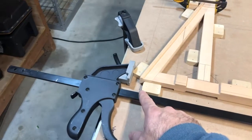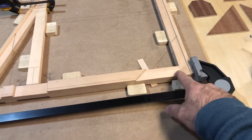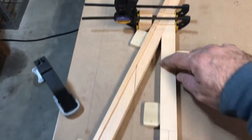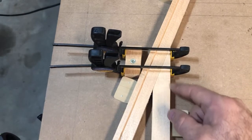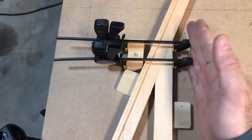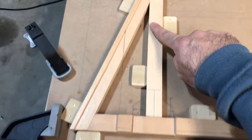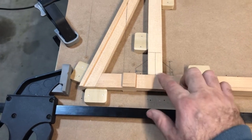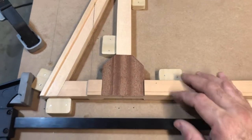This clamp here runs across and is held against this block, so as this piece pushes on that one it puts pressure on this joint and this joint. For this piece here, all I did was put a block there so I had something to clamp to in line with it. This pulls it nicely against the frame, and the piece would try to move down this way, which puts enough pressure on this joint as the glue sets. That joint is going to get a gusset on top of it anyway, which provides most of the strength.